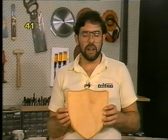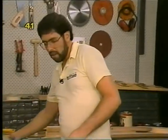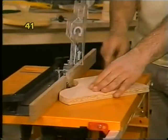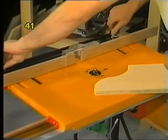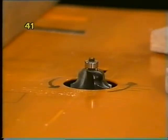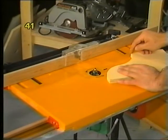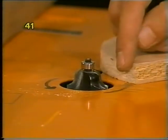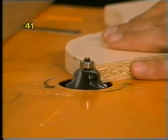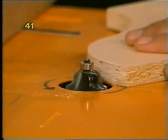If you're trying to make something like a decorative plaque with external curves — no problem, use the fences and safety guard. But internal curves are a problem — with the fence in position you just can't get into the internal area. On these rare occasions, move your fence out, don't use it, and instead use the pilot in its normal mode of operation. You'll have to hold the wood very firmly. When plunging in, this point on the workpiece must approach the pilot at the point closest to you. Hold it firmly and resist any temptation for the router cutter to push you back — going with the cutter is dangerous, so hold it very firmly especially for the plunge in.